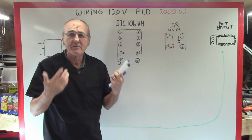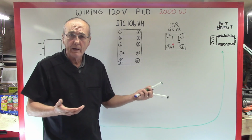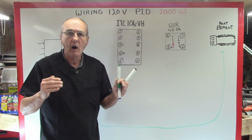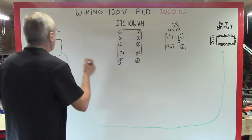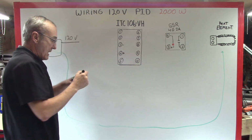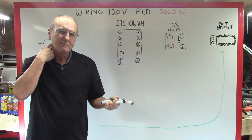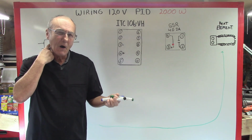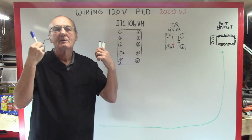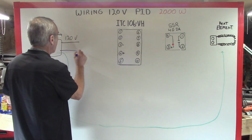Now, incidentally, this is sort of like convention. The convention in electrical wiring is black is hot. Okay, black is your main hot wire for 120 volts. So we've got 120 volts here, and white is known as the neutral wire. You following so far? Yeah. The neutral wire. I'm going to use blue because you'll never see white on the board. So blue is my neutral wire.